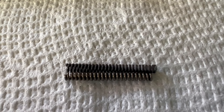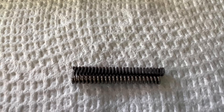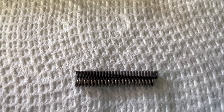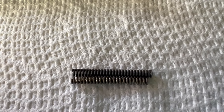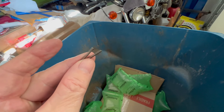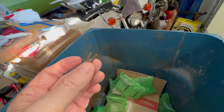One of my theories on the original bolt I was having trouble with was maybe the spring took a set — metallurgy, heat treatment, or something. But nope, they're coming this way from the factory. So if anybody from Wilson Combat is watching this: your ejector springs on the last two BCGs I've purchased — one a year ago and this one I just received from Primary Arms — your stuff is out of spec. We can add another company to the list. Wilson Combat BCG ejector springs: out of spec.